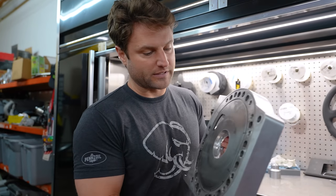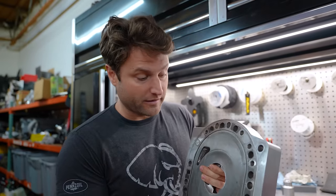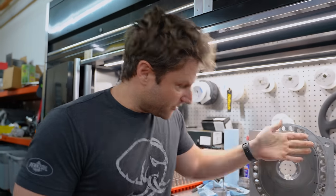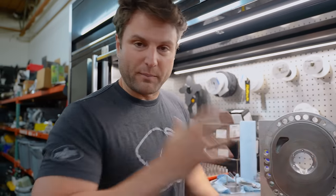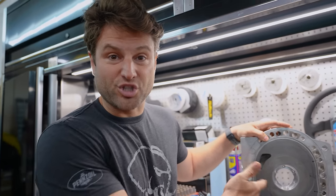So what we're gonna be focusing on is how to increase cooling to the surface so that way the tungsten never experiences over 1000 degrees Fahrenheit. The problem is this coating is rated for exactly that, 950 to 1000 degrees, and that tungsten that is thermally sprayed at about 3000 to 5000 degrees on the surface starts to delaminate, starts to chunk off of the aluminum.